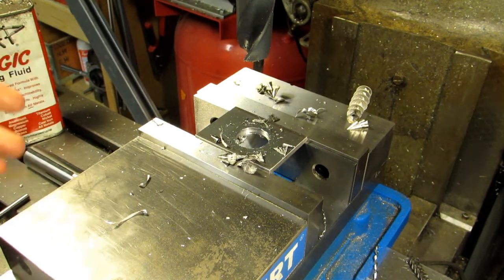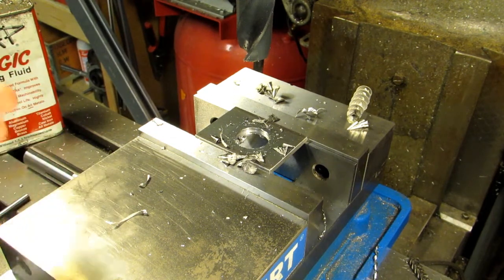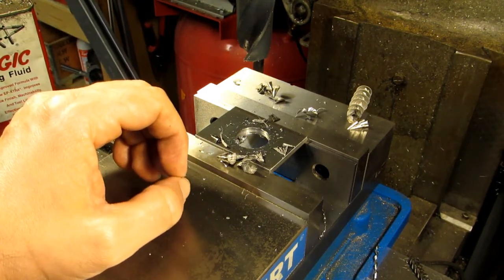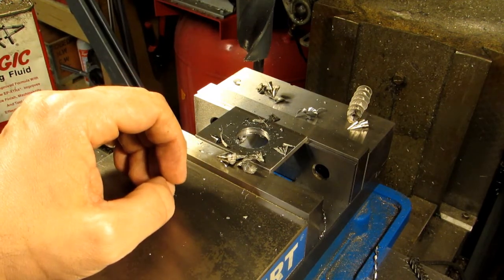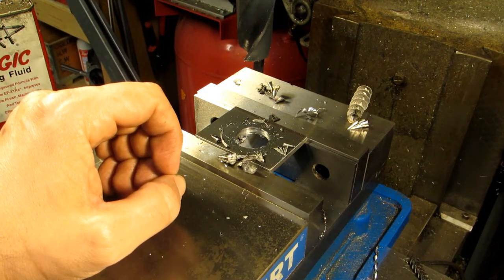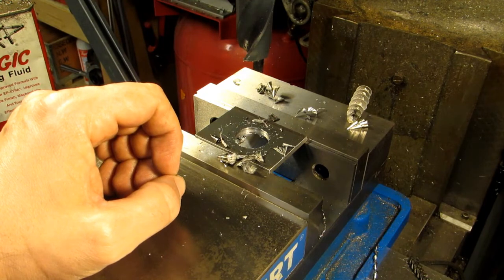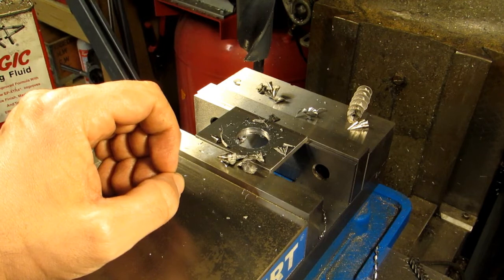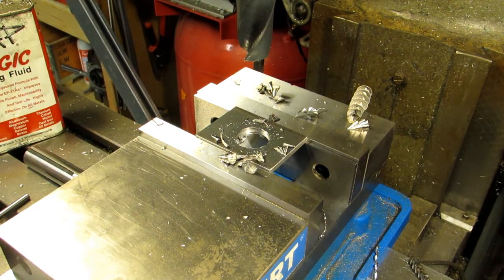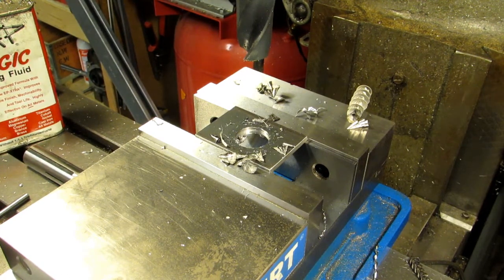One more thing: when should you start pilot drilling? Generally I'll drill from solid stock up to about half an inch or 13 millimeters. That's a bit arbitrary — you can go a bit bigger and still drill from solid stock, but by the time you get to nine-sixteenths you're really having to lean hard on the quill handle or the tailstock handle to get through. So half an inch is a good stopping point for solid drilling; above that I generally drill a pilot hole. The size of your pilot hole depends on the drill size — a quarter inch works probably all the way up to about an inch and a half. Above that you might want to go with three-eighths or even half an inch; half an inch is what I usually use above two inches.